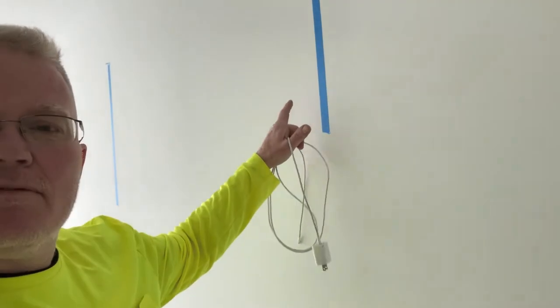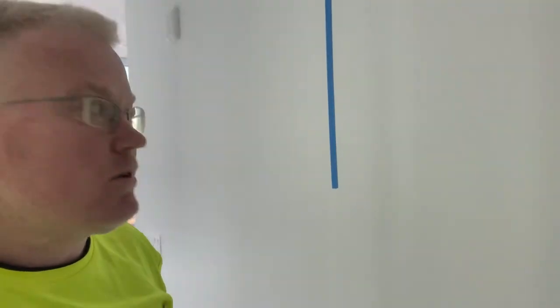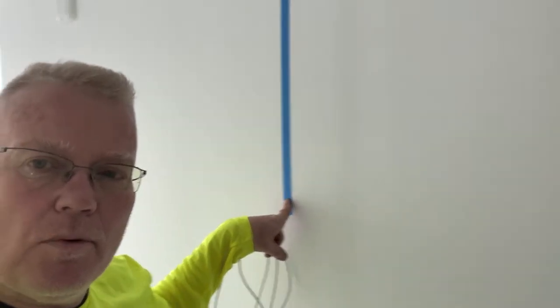Welcome back to my wallpaper and painting channel. Today, we're doing something that is not that easy to do. Take a look behind me. Do you see in the middle of your screen those vertical lines? In the center of your screen, you can see the shadows created by the hills on the vertical seams of the sheetrock. In fact, the customer has placed vertical pieces of tape to show where they want the walls to be brought to normal.